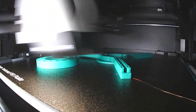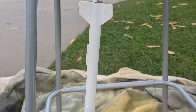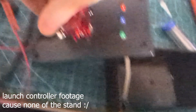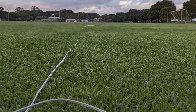I 3D printed a fin jig which would perfectly align the fins on the body tube. If your fins are just a tiny bit out, the rocket can start spiralling out of control, which isn't really ideal. Everything was glued together with PVA glue and after a few days of work, I had a rocket. I also built a fairly rudimentary launch stand out of some scrap wood and a metal rod shoved into it. The launch controller was also fairly basic - basically just two 9 volt batteries wired in series to a switch which would light the motor.